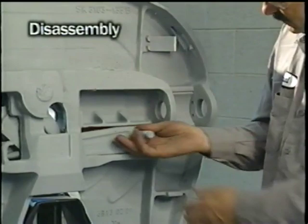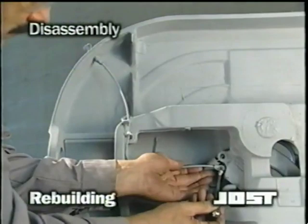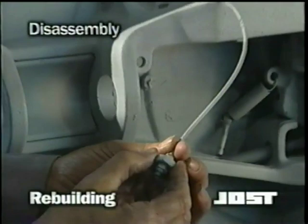Remove the circle ring securing the lock jaw spring and allow the extension spring to relax. Loosen the nut attaching the lubrication line to the casting and remove the lubrication line attached to the lock jaw. Slide the jam nut off the end of the lube line, then slide the lube line through the casting skirt.